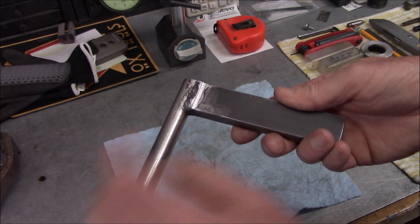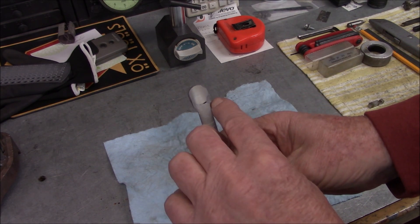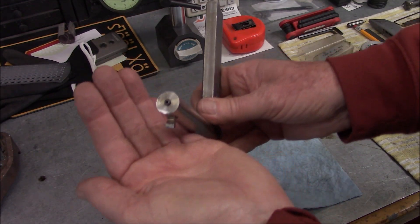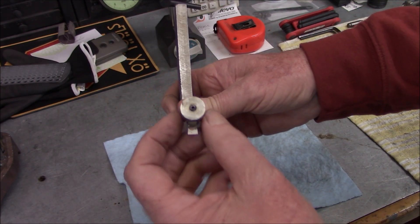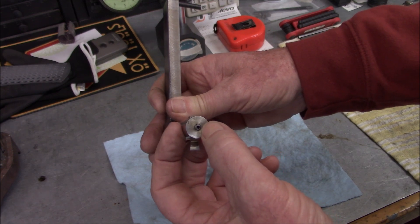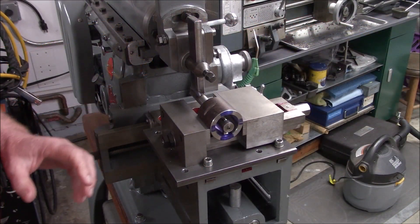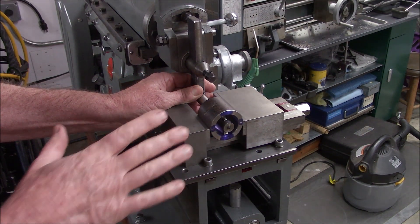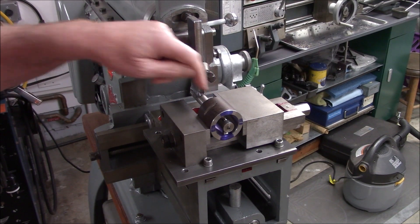Off-camera I used that same radius nose end mill to take a little out of the weld over here. It's not perfectly symmetrical with the other side, but I didn't want to take any more out of that weld than I had to. There it is with the tool bit in there. Little worried about this grub screw - it's kind of small - but we'll try it. If it doesn't hold I might have to drill that out and re-tap it to the next size larger. This boring bar is a little bit long, but I want to get this test done. I'll probably shorten it or broach another hole further back for the tool bit.